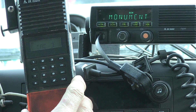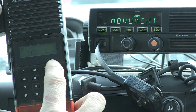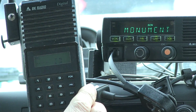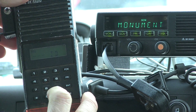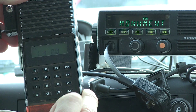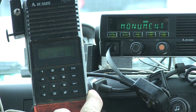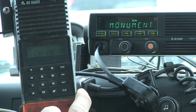Just like going radio to radio on the handhelds, go into program mode — hold down the program button and function. Turn down that volume a little bit. Again, the code is six zeros — press enter. We're at channel zero-zero, and if you wanted to program something you'd press in your channel and start scrolling through to plug in your frequency, but we're going to clone.